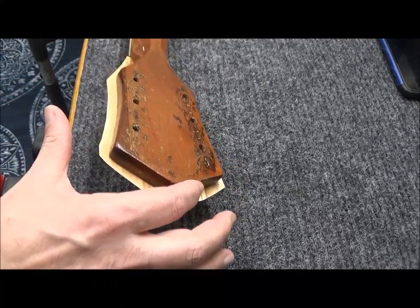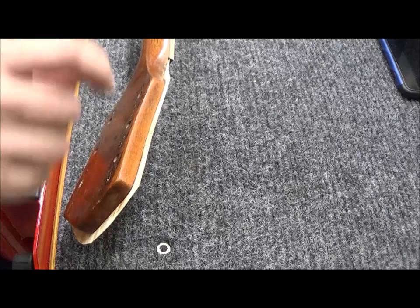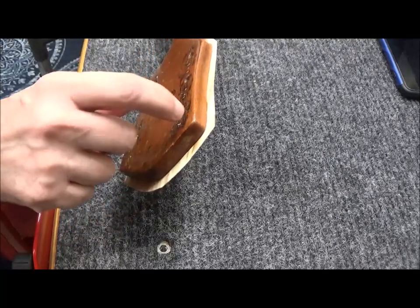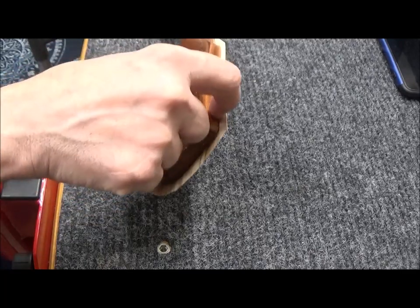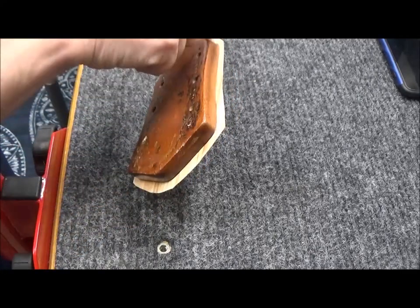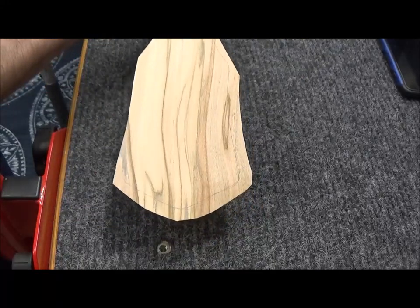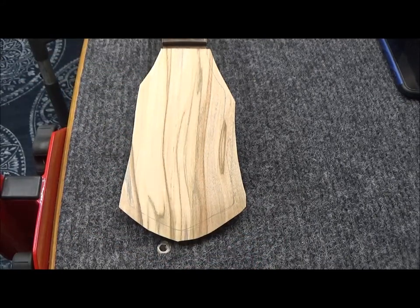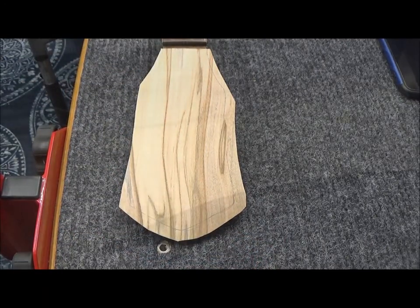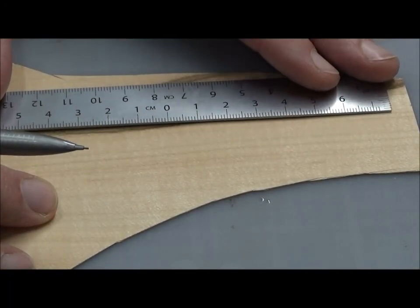The edges are eased a little bit around the edges, so I think what I'm going to do first — especially right here — is go in with some CA glue and put it in gently right along the edges before I trim it. The main thing I want to show in this video is how to trim veneer without it catching a grain line and splitting. Let me put that CA glue in there, and then we'll look at this piece from that same sycamore veneer.